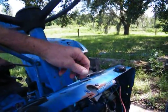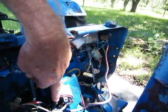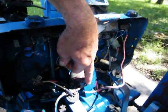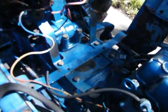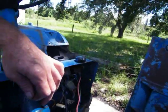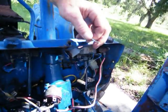I'm not sure where that white wire goes — I gotta look at the schematics. The glow plug indicator right here, the little wire in the middle of it is broke and it wasn't even hooked up. It should go on one of these terminals — I think it's the positive. It just lights up and gets red hot, you know.